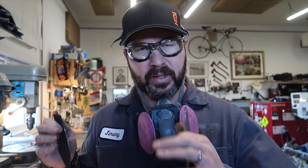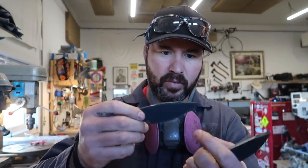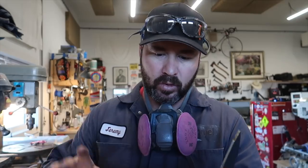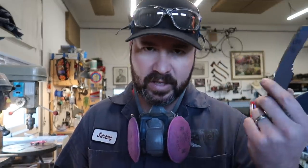We got these things rough cut out with the angle grinder, and now we're going to jump on the belt grinder. I like to use a fairly worn-out 36 or 60 grit ceramic belt to bring the lines right to where we scribed them and get the profiling done. We'll work on the flat platen on my grinder, then jump onto the small contact wheel when we're done. Most of the work — I'd say 96.5% — is done on the flat platen for this knife.